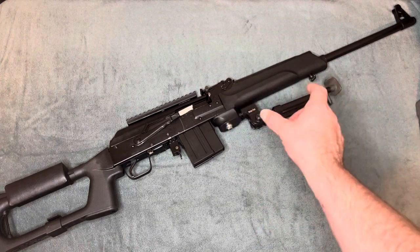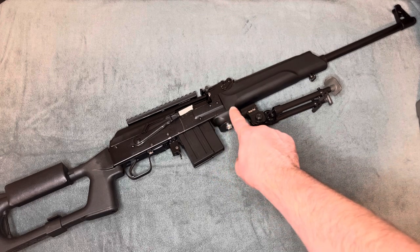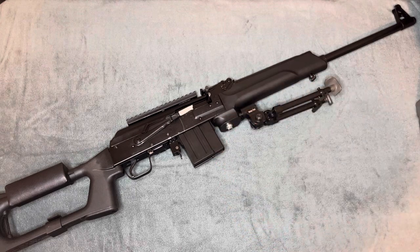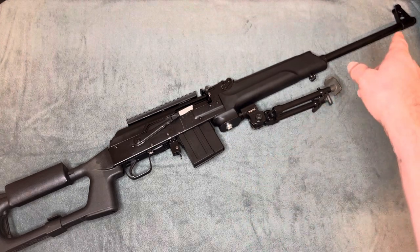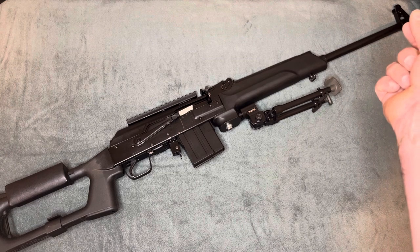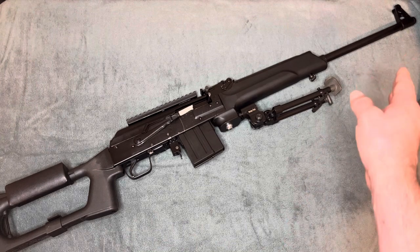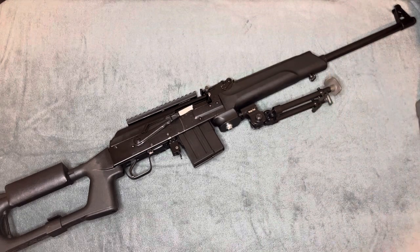I'm going to leave the factory stock forearm. Even though they have dedicated Saiga forearms that don't require any modification, the lineup for this flat Versapod piece will be a little different. I actually had to trim the inside portion of this flat piece to better cradle the factory forearm, and I also bought a spare forearm in case anything happens. I may at one point convert the front end — I'm struggling with that. I'd either want to hog out a 24mm front sight base and apply it, or if I wanted actual threads of 14x1, I'd have to turn the barrel down, and I don't know if I want to do that.